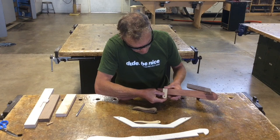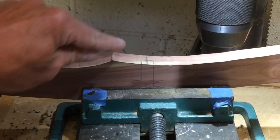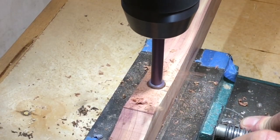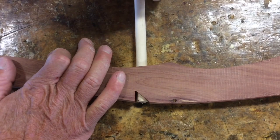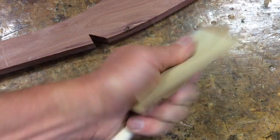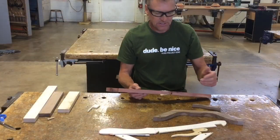There's a part that's going to go right here for the trigger to pivot on, and there's a dowel that goes up here that pushes up and down. The next thing I'm going to do is mark and drill that hole out. This is the point at which I'm going to drill the half-inch hole. What's really important is that these lines on the side are perfectly square with the clamp I'm drilling it with. Now the hole's drilled out and the dowel slides, but not good enough, so I'm going to take some sandpaper and sand it down until it slides super easy in that hole.